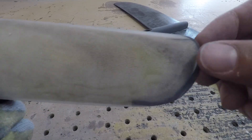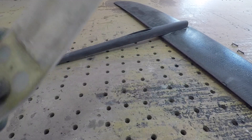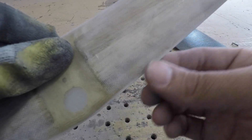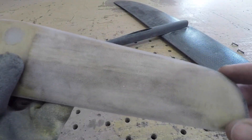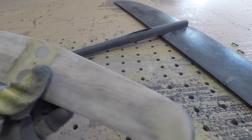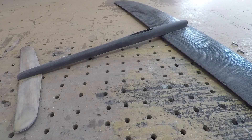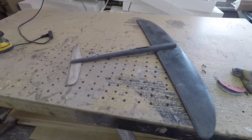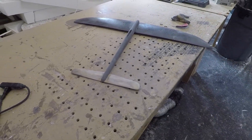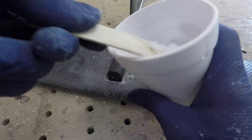The low stab is all cleaned up. You can see the carbon tow we put in on the edges held up and is giving us really nice solid wingtips, and our standard poured edges on the rest of the wing gave us a nice sharp fine edge. It's really starting to come together and look like a whole thing — it's starting to look pretty good. This should hopefully be done by the end of today.